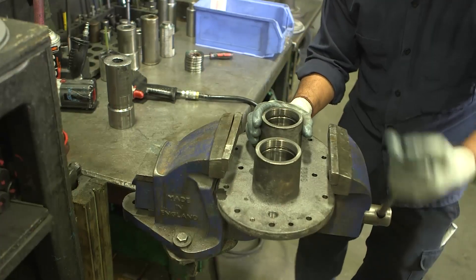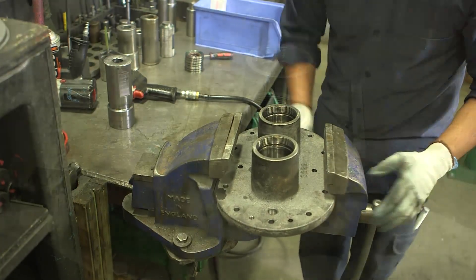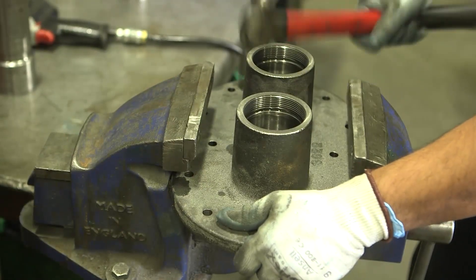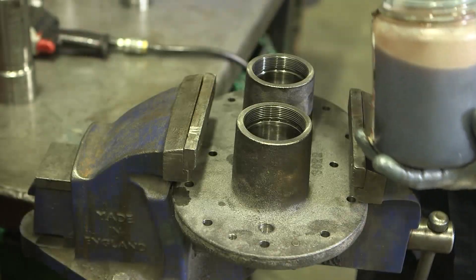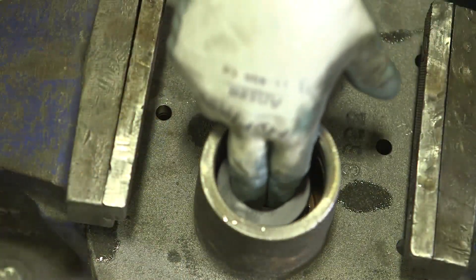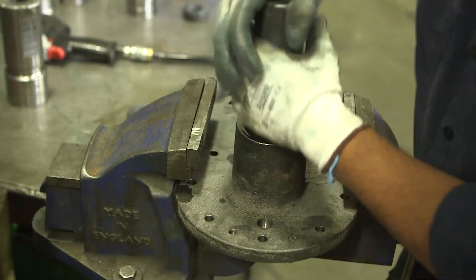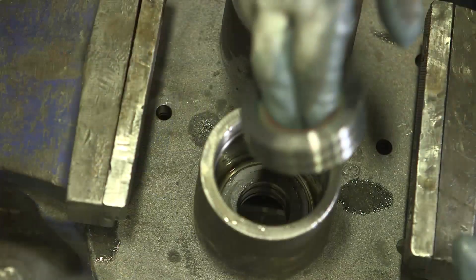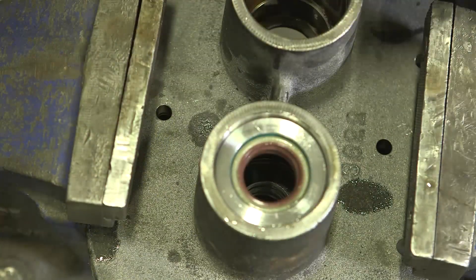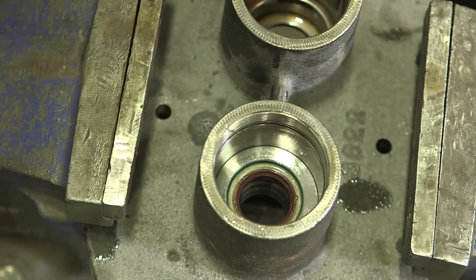To make things easy, anchor the back plate onto a flat surface using vise clamps. If the plate does not have dowel pins, install two dowel pins into the dowel pin holes. Lubricate the inside of the first bearing chamber, then insert two Teflon seals using the seal installer, ensuring the lips of the seal face the inside of the plate. Insert one small seal housing into the bearing chamber with the seal lips facing inwards. Repeat for the second bearing chamber and set the plate aside.